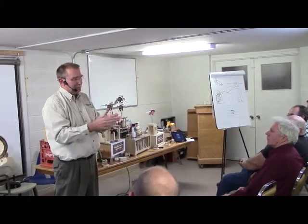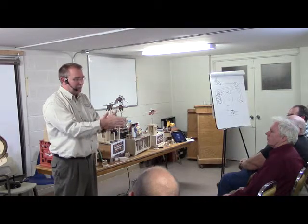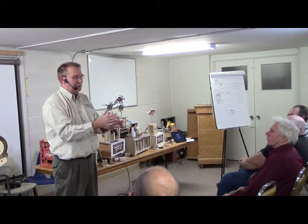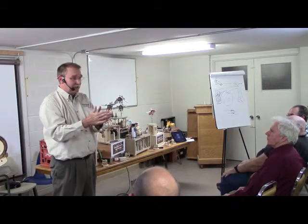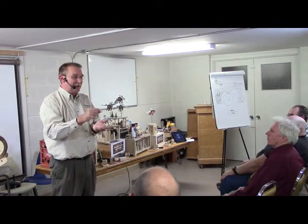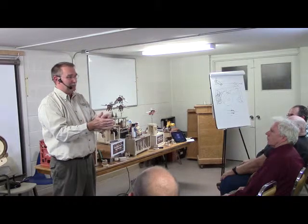You put one on, put the next one, put the follower in, make sure it's in the right place, mark it with a pencil, check it three times. Again, start from the outside, go. And once you start putting them close together, it's hard to get the CA glue down in between them. You can do the front side as you go, but not the back side.